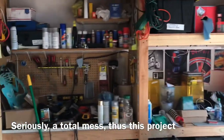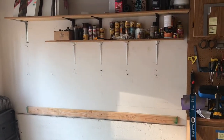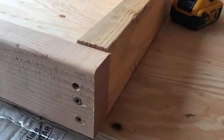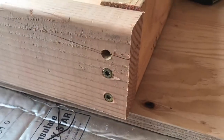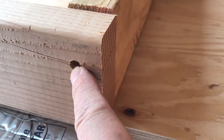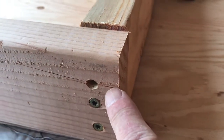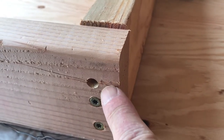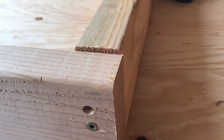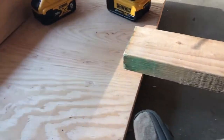When you're drilling screws into lumber, pre-drill your screw holes. Because if you don't — like I did on this one because I forgot when I first started out — you'll get a nice big split in the wood. Now, that's the bottom side so it doesn't matter much. I can pry it open a bit and throw some glue in there and clamp it shut and it'll be fine.